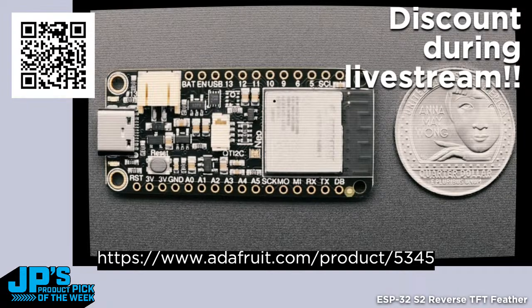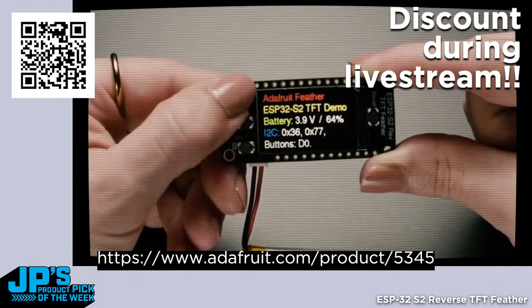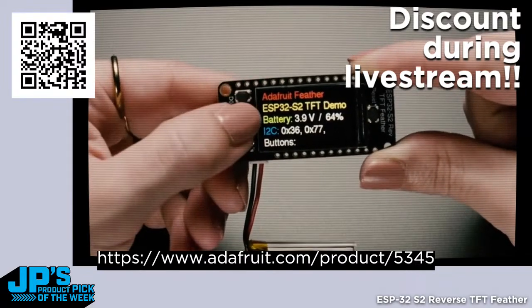Battery charging. Something new is I've updated these feathers. We used to use the LC709203 as a battery monitoring chip. We've moved to the MAX17048. Shouldn't really matter too much for you. It's a very nice ultra low power battery monitor.